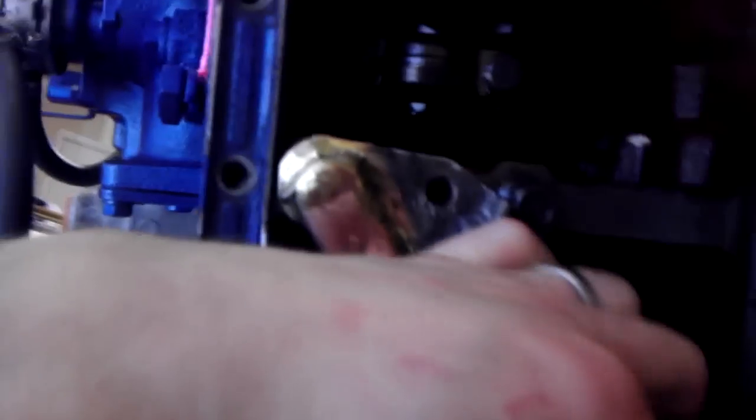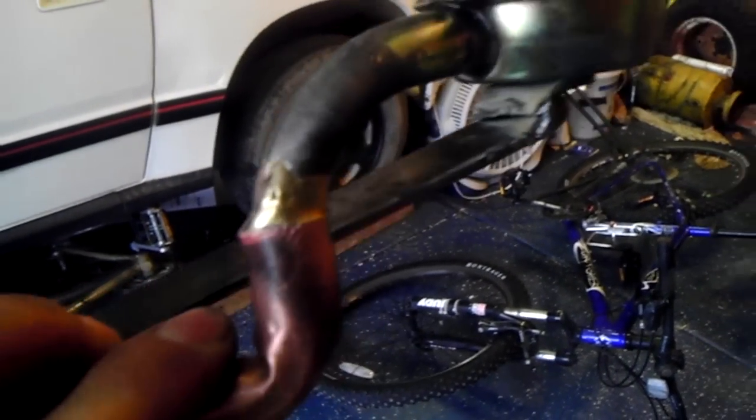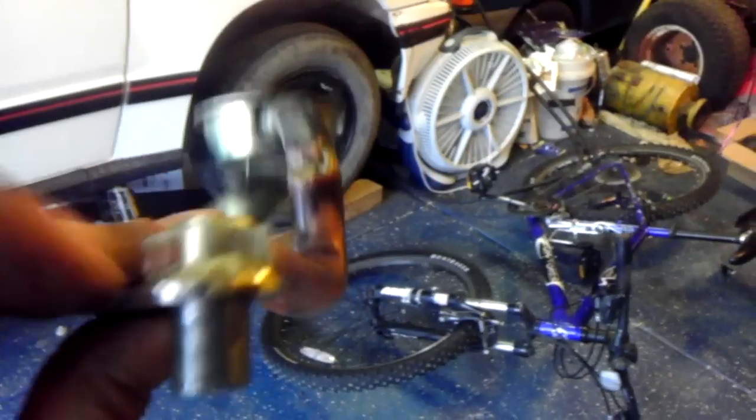So that's going to go right there and pick up from down in there — no problem there. It's sort of ugly but functional. I haven't tested for leaks but this brazing looks pretty good. I bent the copper tube with a torch and then beat on it — packed it with sand to keep the pipe from wrinkling up, and it looked good until I started beating on it. The braze looks decent enough.